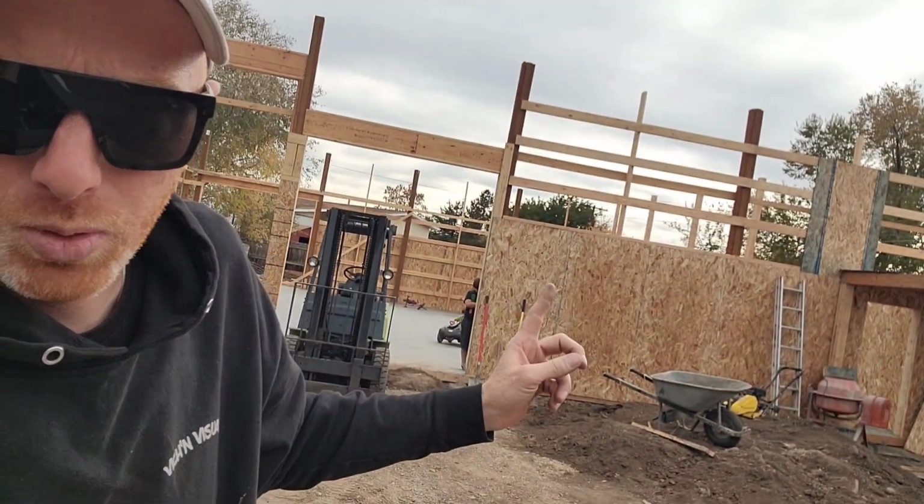Like, this is a problem. So I'm calling and yelling at the pump, or not the concrete company, and they're like, oh, they're on their way. And it still took another 30 minutes after they told me that. So that also added to the problem. When you're trying to cure a pad like this, you're trying to trowel it, and it's curing at different rates because that side got poured an hour and a half different than that side. That makes for difficulty in curing.